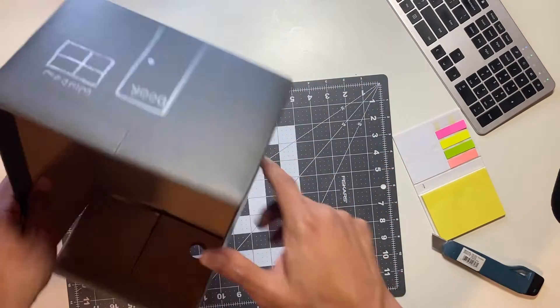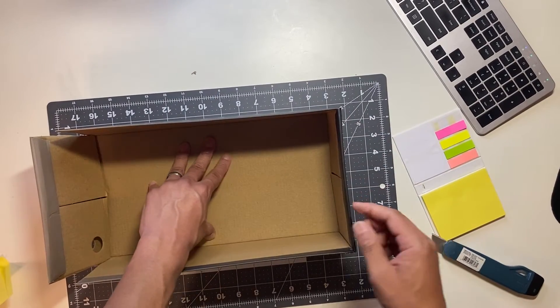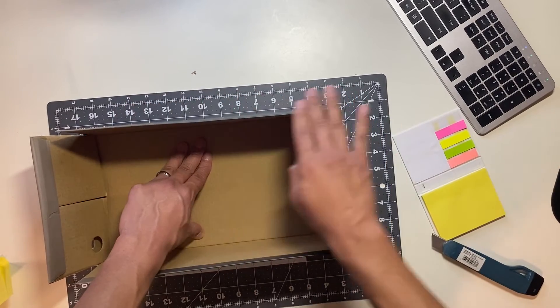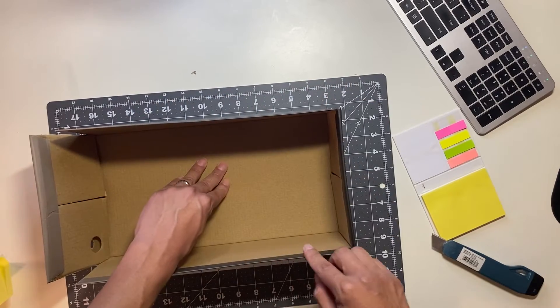Let's flip this box over to the side that is still connected. So far, we've been using the word 'sidewalls.' When I push on this wall, these sidewalls hold this wall up. Well, another word for 'side' is 'lateral.' Did a light bulb just go off in your head when you heard the word lateral? Because you hear the expression 'lateral forces' all the time — and that's what it is. Shear walls resist forces that come from a lateral direction. It works both ways: when you put a force into a wall, it gets transferred to a lateral wall. Now you know why it's called a lateral force.